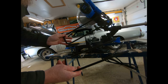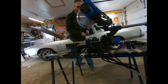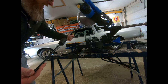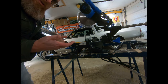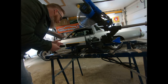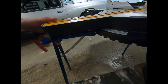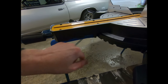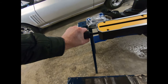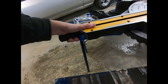These two little brackets are fairly simple — they just slide in here. This piece here is the handle that goes in so you can lock and unlock the table turning back and forth. We'll slide that into the front hole. The way this works is there's a little lock right here — when I pull that up it will unlock the little tooth and lock it into common angles such as 22.5 and 45 degrees. But this handle, when it's screwed and locked in, no matter how much you try it's not going to move. If you loosen it and then pull this, you can turn the whole device.